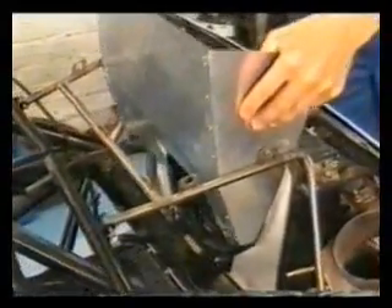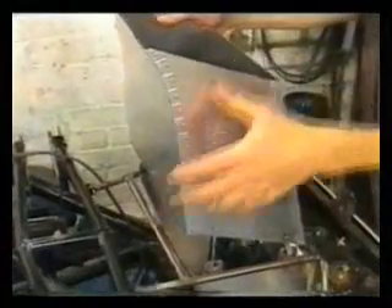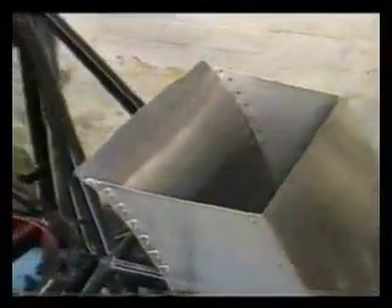This is the back side of the radiator — again it's critical for the air to find its way out. Most people just force air through the radiator and leave it to find its own way out. So that's the air duct there, and then this bit also sits on and then goes up out of the bonnet. Because there's a big hole there and it's open in the bonnet, rain will come in, so I made a little rain channel that will fix down there to divert the water off and then it will drain out.